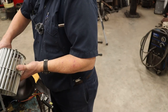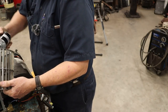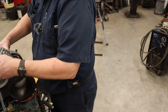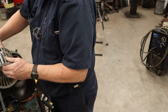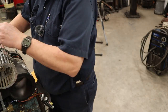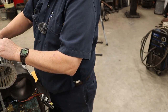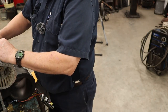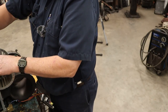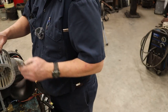It'll be okay. We laid this motor right here so we know exactly how this one goes on. We stick it in there with the flat part, because this motor shaft is D-shaped. So we put the D-shape right where our set screw's at. We're just gonna snug this down a little bit. We'll probably have to make some fine adjustments. I'm gonna put it back just about like it was, because that ought to be pretty close. And I'm gonna go ahead and torque this to factory spec.